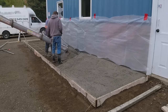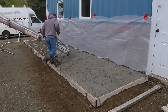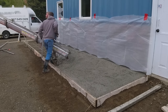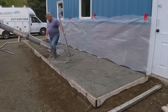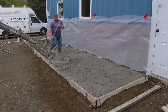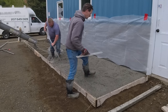When only two of us come to pour and finish concrete, we've got a plan in place. One guy does one thing, one guy does another. I'll be running the chute and pulling up the rebar, Luke's tuning things in with the rake, spreading things out. We'll get a certain amount dumped out, then mag-float our edges, get it screeded, get it bull-floated. After we get it all poured in place, we'll have a little bit of time before we have to go back and stamp it.